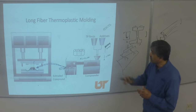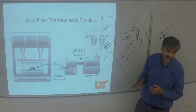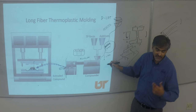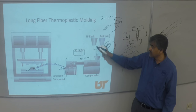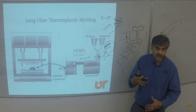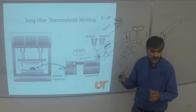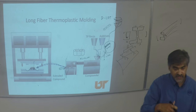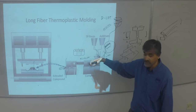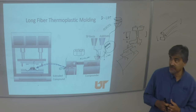The charge gets transferred manually or robotically to the press. In industry this would be in-line with a robot. The press comes down, the charge with all the fibers flows and fills the part, and you can get very complex near-net-shape parts. This is now heavily used in the automotive industry, particularly polypropylene-based because of the cost of the material. Companies like Dieffenbacher, Engel, and Arburg in Germany and Austria have pioneered a process called Direct LFT (DLFT) — they feed direct fiber spools straight to the extruder. While extruding, the fiber is chopped and fed right there along with the polymer, eliminating the pelletizing step entirely.